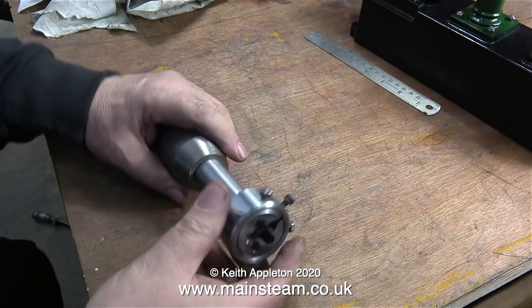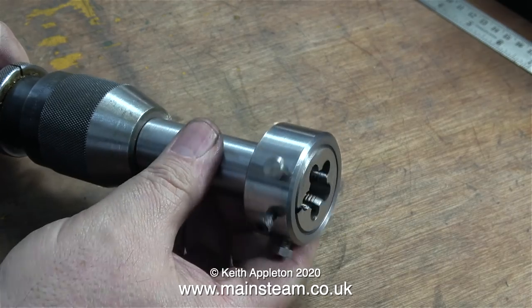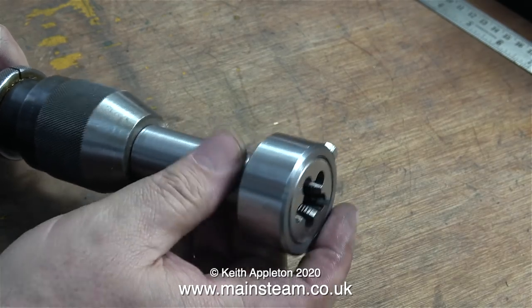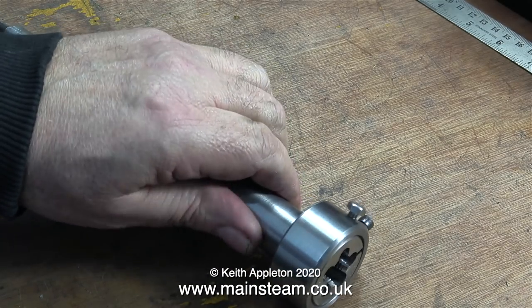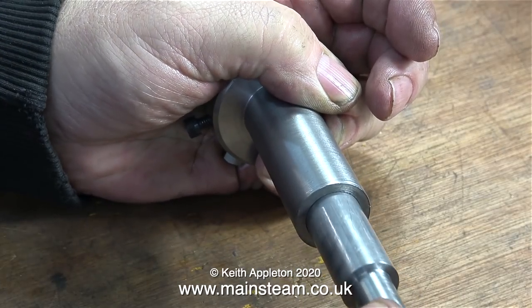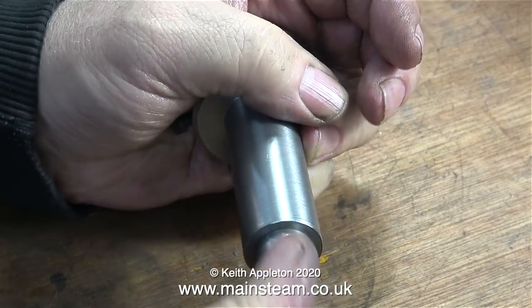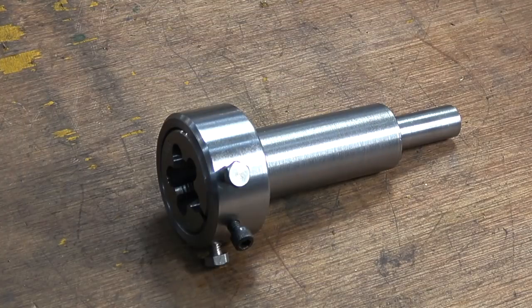Here you see the principle on the bench. The end of the bar that I've reduced in diameter fits in the tailstock chuck, and then the tailstock die holder is free to slide back and forth on this piece of metal. It needs to be a piston fit on the bar - it doesn't need to be tight; in fact it's definitely counterproductive if the bar is too tight a fit, as any threads you are cutting move the die holder back and forth. I've got my hand over the end to make the end of the die holder airtight, hence the popping noise. I've still got to make, drill, and thread the operating arm, fit it to the die holder, and then it's done. Thanks for watching this short series and I hope you found it useful.